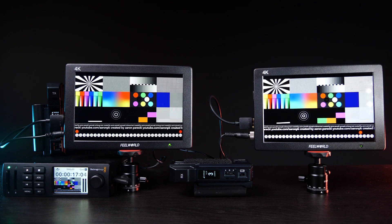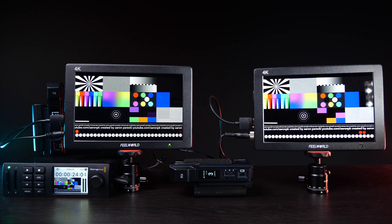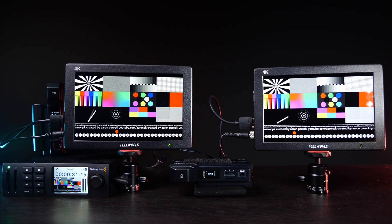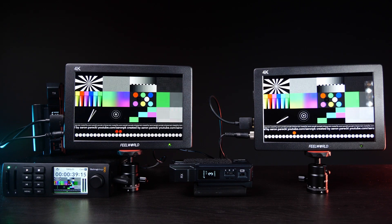Here's the clip playing at 30 frames per second. The HyperDeck is the player, which is what we're comparing to. This first monitor shows the output of the pass-through of the transmitter. Keep in mind there are a few places where a delay could be added. If we compare the visual output of the HyperDeck to the monitor, the delay is being added either at the HDMI out of the HyperDeck compared to what it's showing on screen, or in the transmitter, or in the monitor itself. Since we're using the same monitor to test both the transmitter and receiver, we can discount the monitor's delay. On the right is the monitor of the receiver. It's hard to see the delay when the clip is moving, but if you pause the video or if I take a still photo, you'll see a freeze frame showing the frame counter and you can count how many frames off it is.